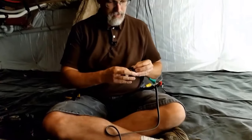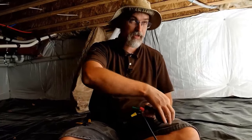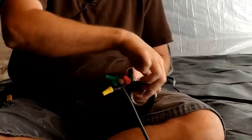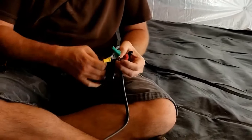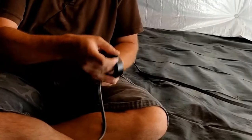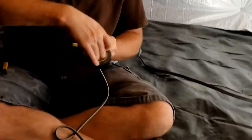I'm going to tape up the unused black wire — I'll overkill that one just to indicate I'm not doing anything with it. I'll also tape a few other connections up just in case a kid gets into the crawl space and accidentally touches something. Normally these won't be plugged in until I really tie them into the whole house, and I'm not going to do that for a while.